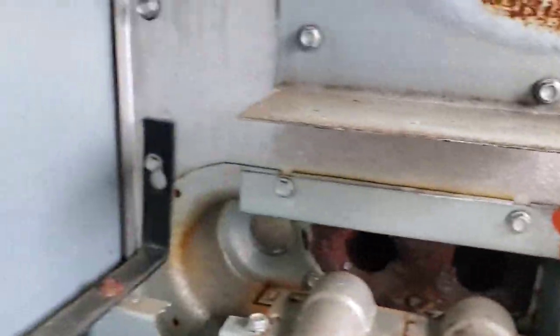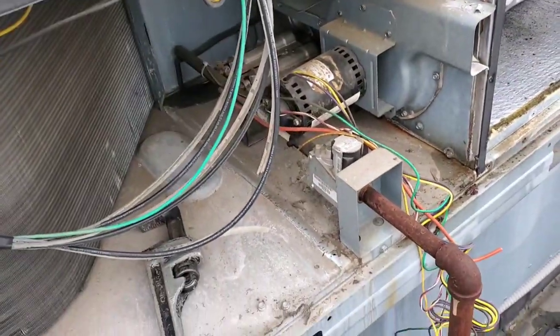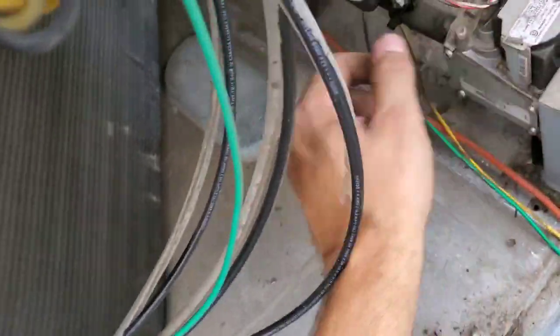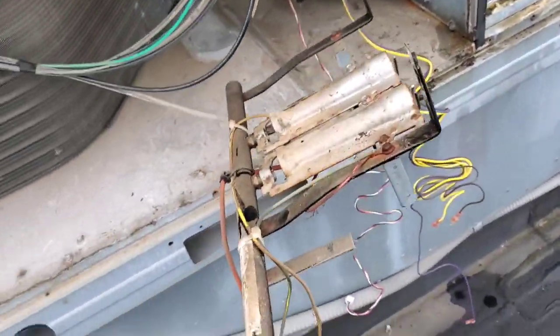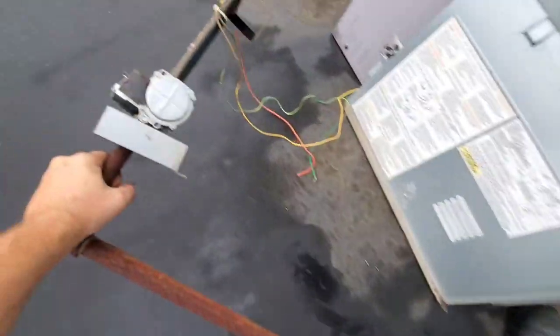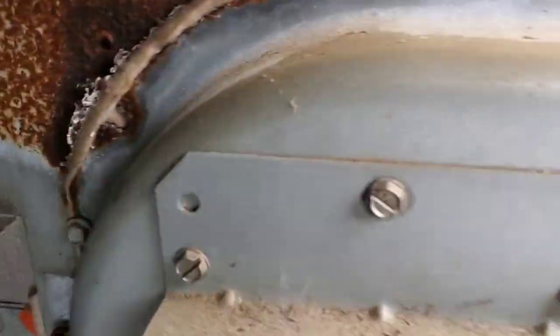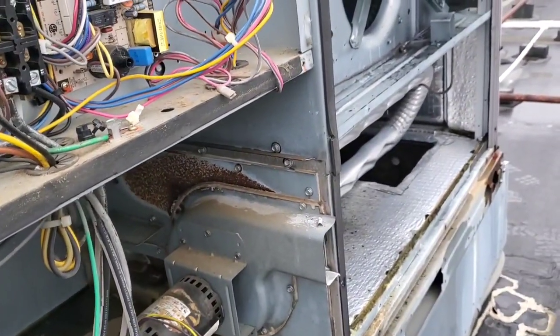Now suddenly we can get to the burner rack. There are some little keyhole screw holes there. Loosen those two screws and undo the gas line, and the whole burner assembly comes out. Don't forget that screw - those three screws and the one union that hopefully exists. It's actually easy enough that I can do it one-handed while I'm recording this. That's the whole burner assembly right there. With that out of the way, we no longer have a hard time getting all of those screws. Look at the rust - holy shit, that's worse than I thought it was. I got nine screws to remove and the whole heat exchanger just kind of falls out.